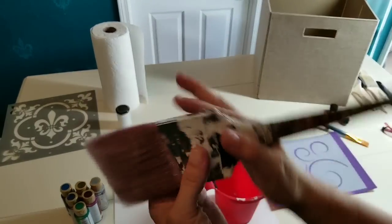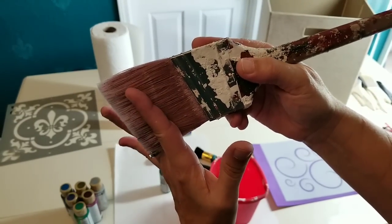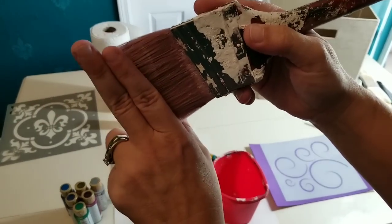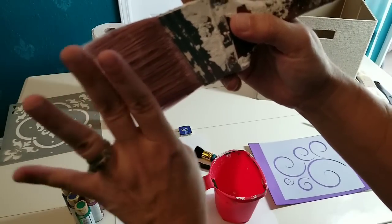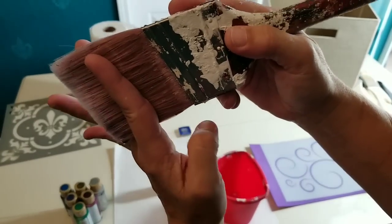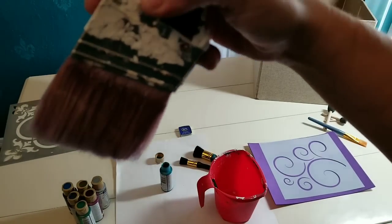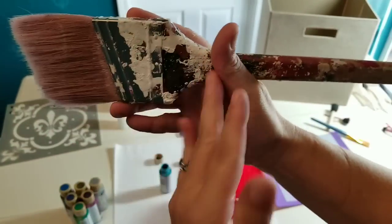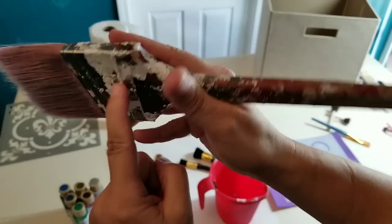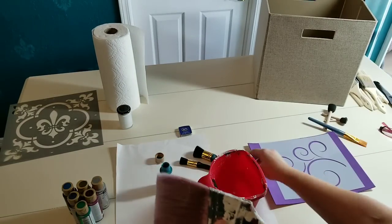But when you're actually trimming, not that you asked, you only want to dip about the top third of your bristles. Maybe not even two fingers deep, a thumb deep. That's all the further you put that in the can. Just there. You don't dip it all the way to there. You don't have paint running. This is not from me. This is somebody else who painted. It should not be getting all over this. It should be clean all the time.